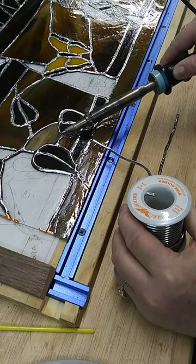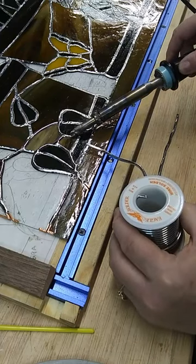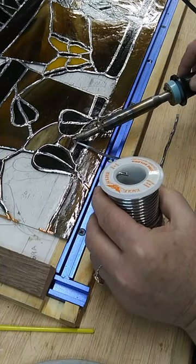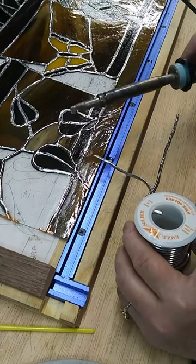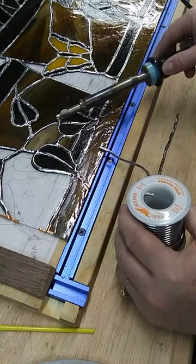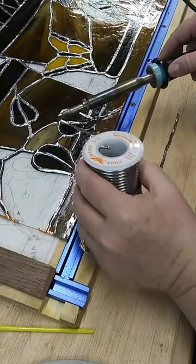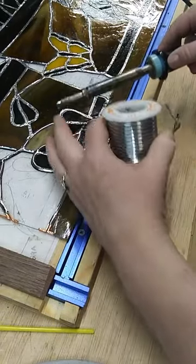The other thing you can do if you've got a lot of solder built up is you can slide it straight off. Either pick straight up or slide it straight off. You don't want to paint with it. Don't be a painter. And what I mean by that is you're laying your solder down and you lift up and away. What's going to happen is you're going to leave a trail of solder and it's going to freeze midway. You don't want that. And that's what makes those little barbs.